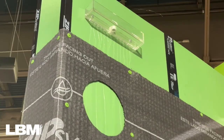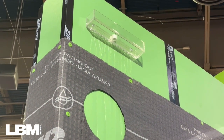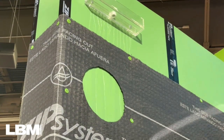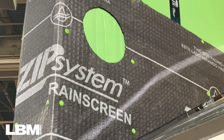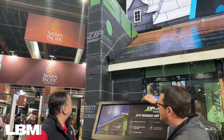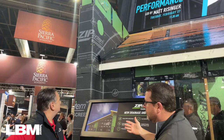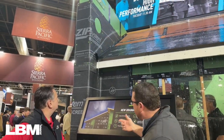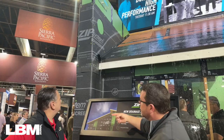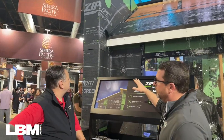What we're showing here is water at the top of the wall, demonstrating that quarter-inch space, and showing that water going behind the rain screen against our sheathing and draining down. We created that space. That water's draining all the way down the wall. And once that moisture's done, it's going to allow air to come up through the bottom and travel all the way up through the top of your wall's cavity to dry out that moisture.